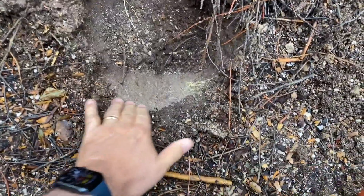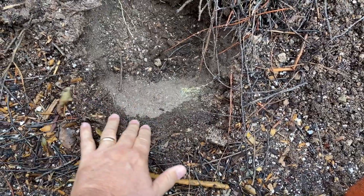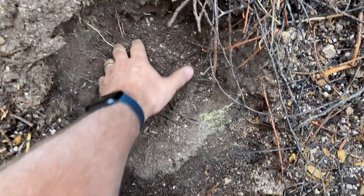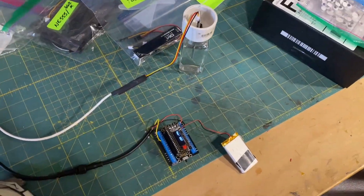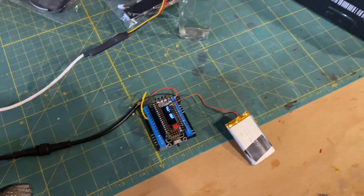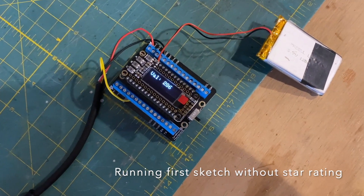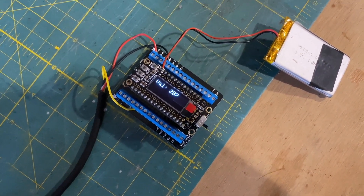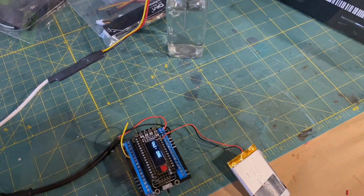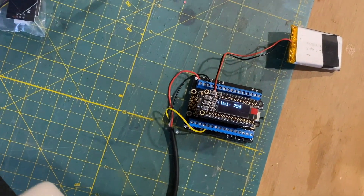You can see with all that rain that the wetting profile is maybe an inch, maybe two inches deep. Things feel pretty dry further down, though there's a little moisture. This little sensor has been sitting in a jar of water for the last two days with no power. I just plugged in a battery and you can see that the reading is right about where it should be for the air and water test. It hasn't varied, which is a good sign. The sensor's now been removed and there's the value for the removed sensor.